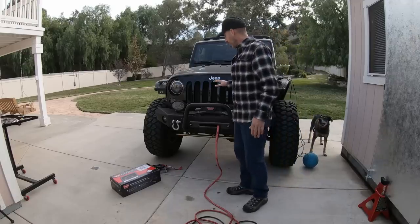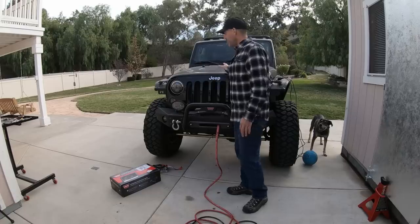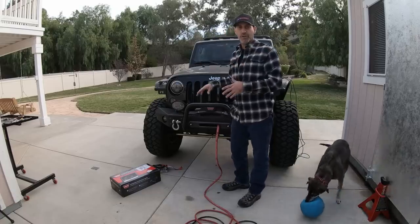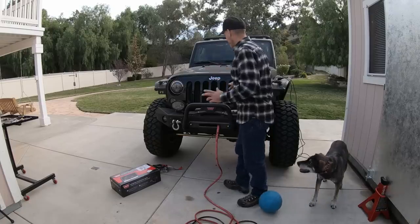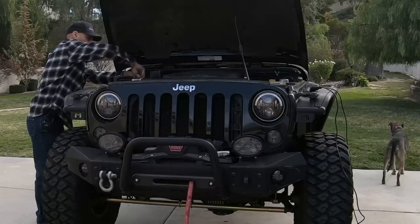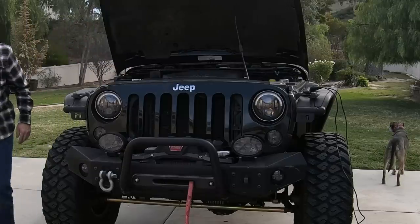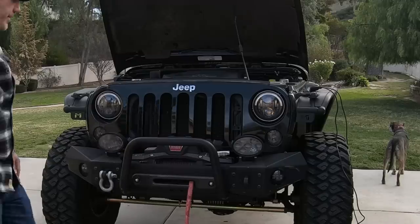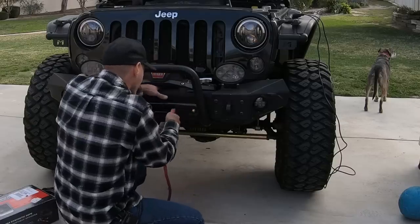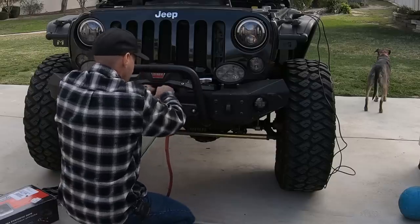Now I'm unplugging the controller, and anytime you're going to have your fingers down working on the drum, it's a good idea to disconnect the battery in case things want to go maximum overdrive and try to turn on while you've got your fingers in there. So we'll do that. Battery's safe. Now let's get in here. Now we know that our winch is safe — it's not going to try to attack us.